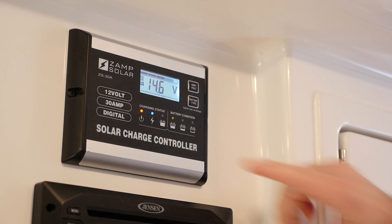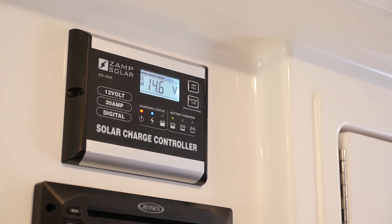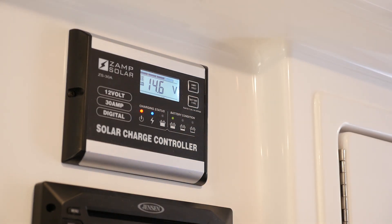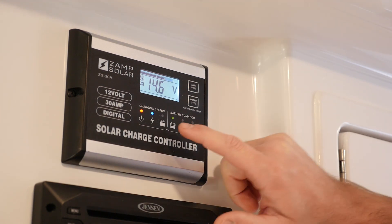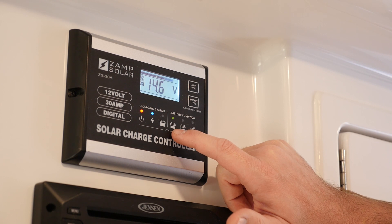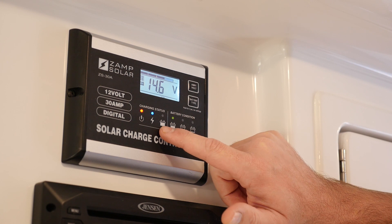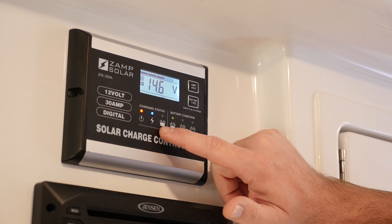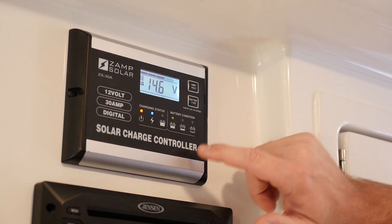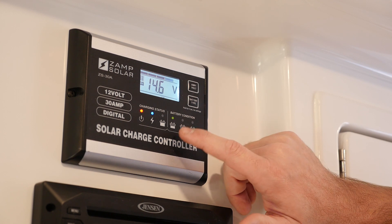This light and the voltage reading may not always go hand in hand. The 14.6 volts you're seeing is because it's in an absorption state — when it shows that, you may see higher voltage than what's actually in the battery. When it shows a full state, you'll usually see about 13.6 volts and it'll be in a float charge state. Bulk charging can occur at any of the other states.